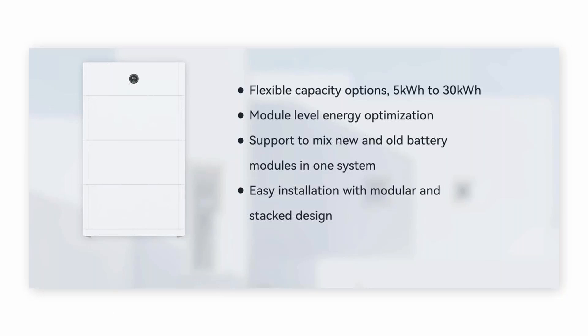For the APX battery, each string can connect a maximum of six batteries, that is 30kWh. There is no need to worry about the SOC gap. With older batteries, when you add a new battery, you need to make the SOC approximately the same to avoid an SOC gap. But with this battery, it can automatically balance the SOC. So if a customer wants a new battery, you can just link them together and the whole system will do the automatic balancing.